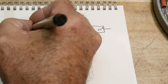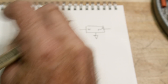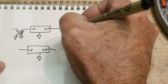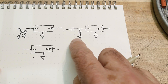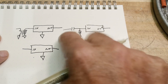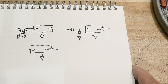Sometimes you'll see circuits where there'll be a matching transformer where one side is 50 ohms and one side is 1,000 ohms, and you can put that on the output as well. Or you might see a circuit with some type of matching network — just like you would have on an antenna — a capacitor and an inductor tuned for the frequency, matched to go from 50 ohms into 1,000 ohms. Like a T network or L network.